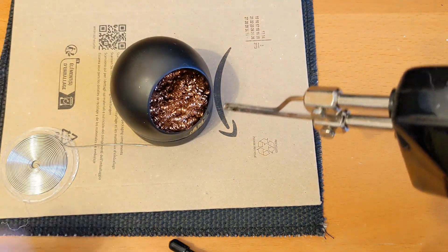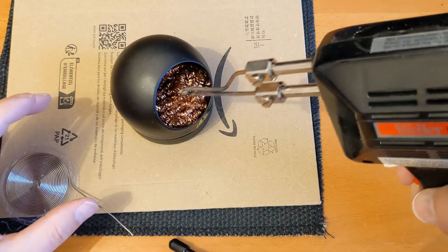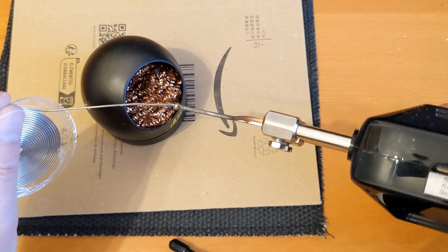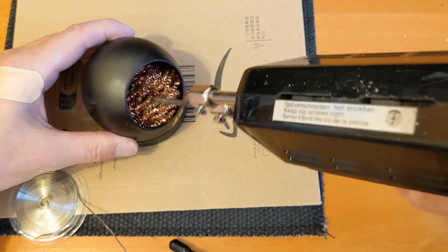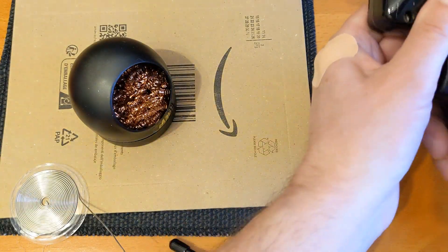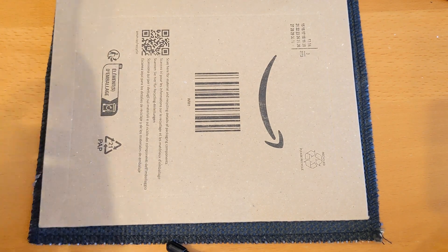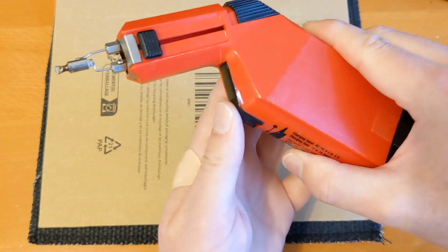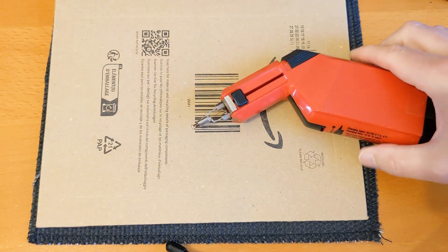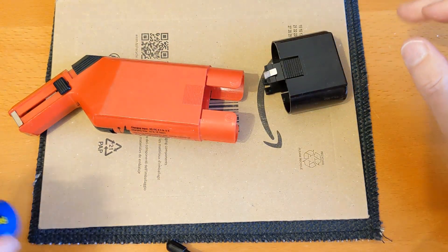I need to open the window. This tip tinner is designed to get old solder off your soldering iron tip - I'll wait for that to warm up again and just dab it in. You can see it's already melting - just dab it in there and it takes the solder off, leaving your tip nice and shiny. Be careful not to burn yourself. It's a Weller universal. I've seen one for sale locally in much worse condition than mine. I've opened the windows now for airflow, because you don't want to be breathing in solder fumes. Honestly, don't copy me - it's not safe, I have no idea what I'm doing, I've made it up as I've gone along since I was a kid. There are soldering tutorials on YouTube - have a look at one of those and take advice from someone who knows what they're doing.